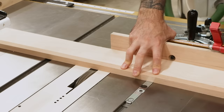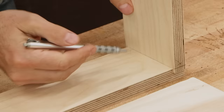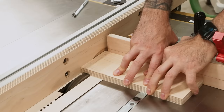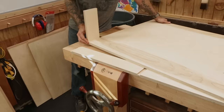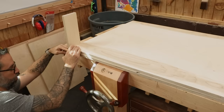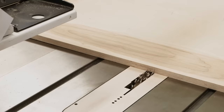With the center line on a piece of scrap plywood, I line up the center lines and trace the outside edges of the plywood — that shows me the exact location of the dado. Back at the table saw, I line up the work piece, set the fence, and cut the dados in the bottom stretcher and toe kick. It's totally worth the extra effort to center the divider because if you don't, your two drawer sets will be different sizes. Next, we need to locate the dado in the large shelf that accepts the top of the short divider.